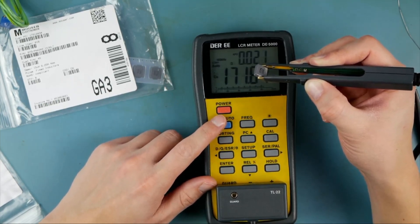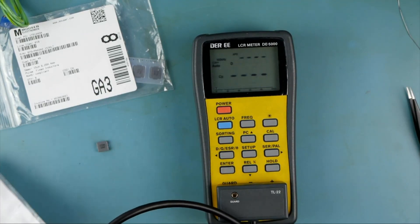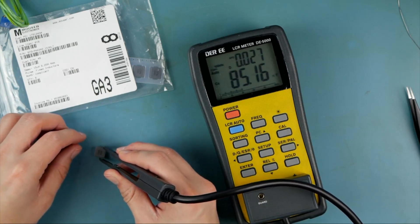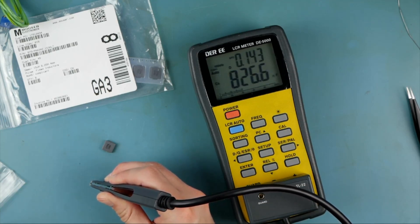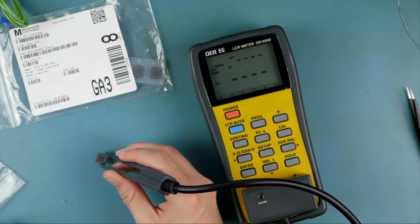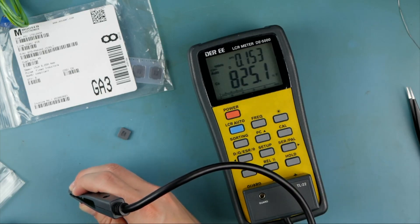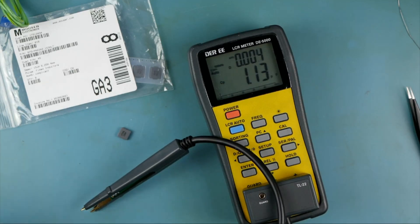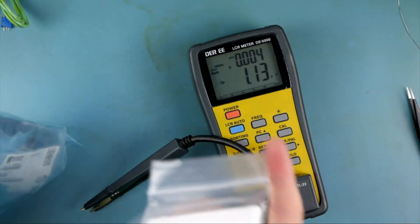Let's bump this down to 10 kilohertz: 15.16 µH. It looks like it just starts to fall off a little bit, which makes sense because the parasitic effects of this inductor at higher frequencies are naturally going to be more than a tiny one, just because the physical construction is bigger — you're going to have more capacitance in those windings. And if we switch over to capacitance mode, that's exactly what we'd see. 170 nanofarads — and this one is also 171 nanofarads. The meter tells us what it really is, not what we think it is or what the datasheet says.